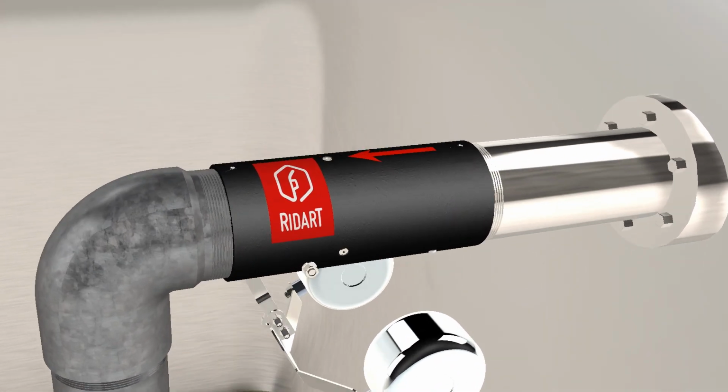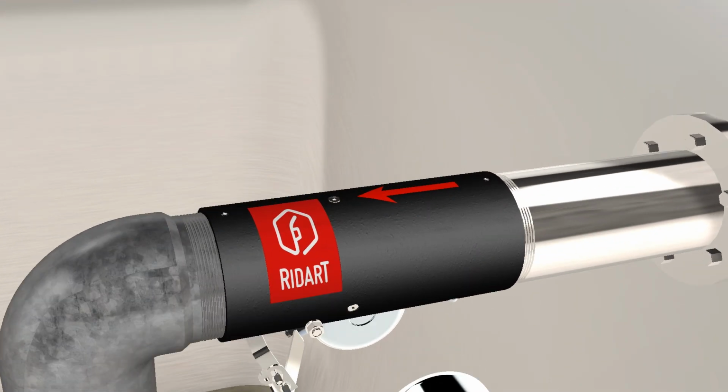The body of the valve can be selected as anodized aluminum or aluminum coated with PTFE. Regardless of the coating, the valve must fulfill requirements concerning electrical conductivity. In order to do that, 2 pin screws are present that must be unscrewed before installation and tightened after. This ensures a correct discharging path for the current, bypassing the insulating coating of the valve.